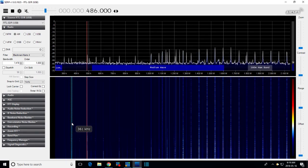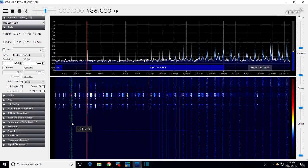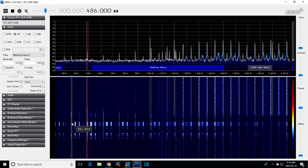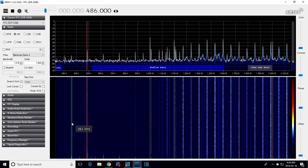Okay, so sweep generator connected to the antenna, no clip lead now, and I'm going to put the SDR back on the plate. There we go. We're on. Where's the sweep thing? Where'd it go? Oh, yeah. Okay, so one thing, we're not looking at the actual signal. What you're seeing on the SDR is the output of the plate. Get it right, Jim. And we're still sweeping at a slow rate. I'm going to make it 1 second because it's just a little easier to see.